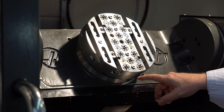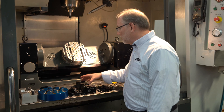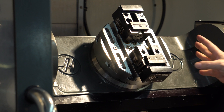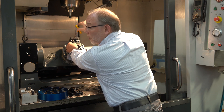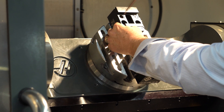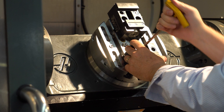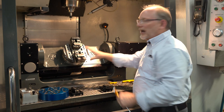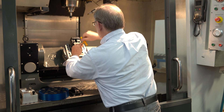As you can see, we've got it set up with three T-slot fasteners in here — I'm going to add one in a minute when we load the riser. I'm going to quick-load these flex vices on there, then bring our fastener up into the piece and hold it. You can see it's going to be pretty fast. This pattern works for this part — it's a two-inch pattern. Of course, I could have pulled up all of them, but I'm trying to save time on the video.